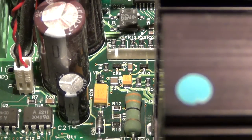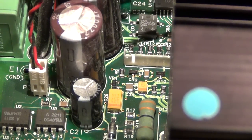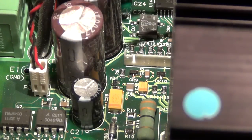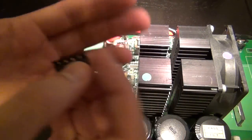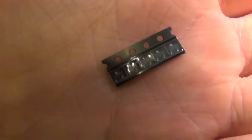What I can do is try to replace that diode. I knew this component was likely broken from earlier, so I went ahead and ordered replacements from Digikey — only about 50 cents each. I ordered five. Here they are — they look just like the ones in the equipment. Soldering a new one in shouldn't be as hard as unsoldering the broken one, but the heat sinks are in the way and they're difficult to remove because there are regulators screwed on to them.